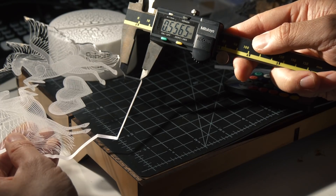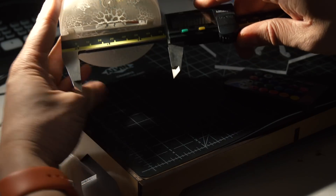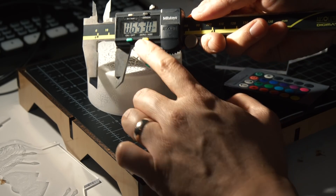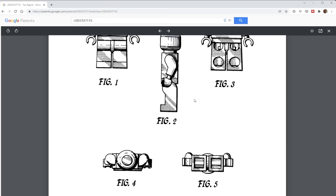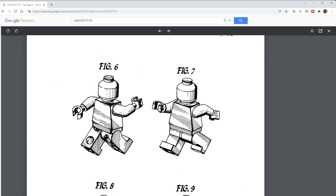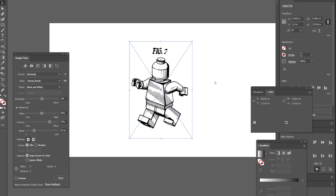The first thing I did was take my calipers and measure how the acrylic embedded into this puck - the depth and width of it - to know exactly how to make my own sign that would fit into this same base. Next up was coming up with the design. We're big fans of Lego, so I pulled up the Lego minifig patent design, picked the pose I liked, clipped it out, and brought it into Adobe Illustrator. Using Illustrator's trace function, we turn this rasterized image into vectors that we can engrave, score, or cut.